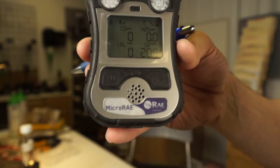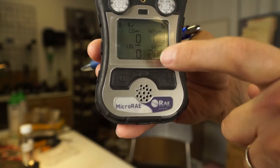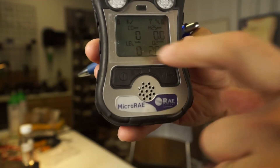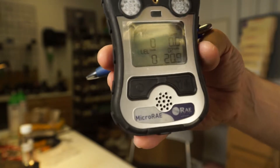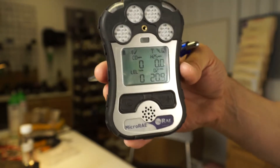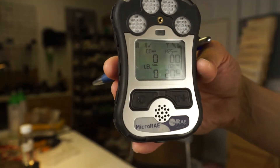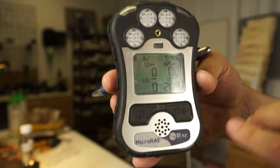When I hit one more time or simply wait about 30 seconds, it will come back to the main screen. The main screen is your four gas readings: carbon monoxide, LEL, H2S, and oxygen. The upper left-hand corner is a battery icon — as it lightens up like a gas gauge, you can see how much battery is left. Next to that is your Bluetooth symbol. If Bluetooth is enabled, you'll see a check mark next to it, telling you that all the criteria I programmed into the instrument have been met.